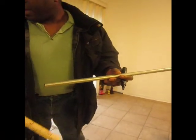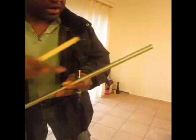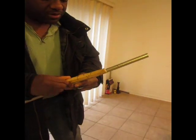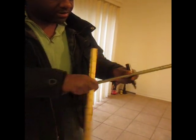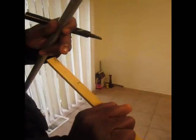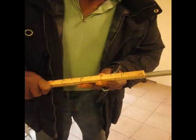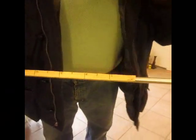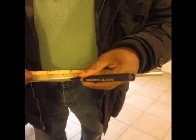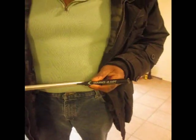I want it to be at 30 degrees. So I've got my first mark, and I'm going to lay the offset ruler right here at the 30-degree mark. It says right on the offset ruler: 30 degrees. It has 45 degrees, 30 degrees, 22 degrees, and 10 degrees. I'm going to line up the end of the ruler at the 30-degree mark, come over to where it says 3, and make another mark. So there's my 3. I'm going to make it go all the way around the pipe.